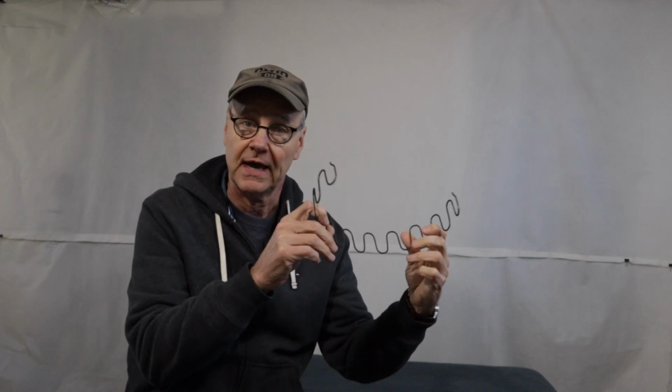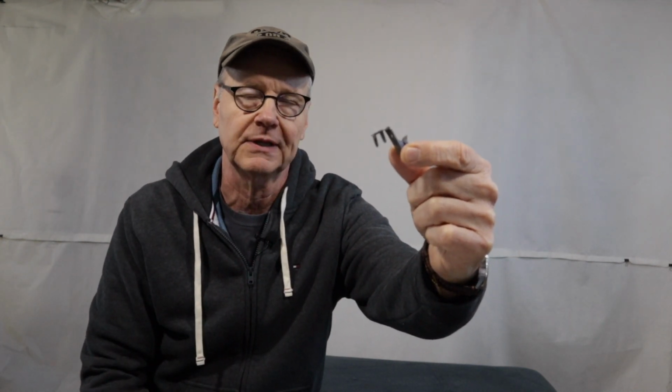As far as replacement springs are concerned, it's usually best to use the manufacturer replacement parts when you can. That way your springs will be cut to length, like this one, and ready to install. And while you're at it, you can order any replacement clips you may need as well. Here's one of the spring clips used on this back. It has prongs on one end that are hammered into the frame to hold it in place, and the U-shaped end is where the spring attaches.